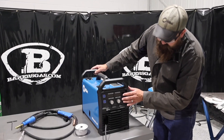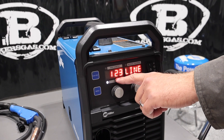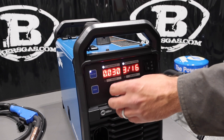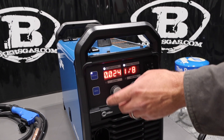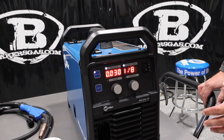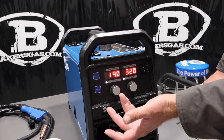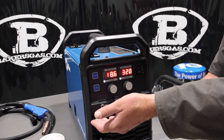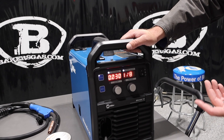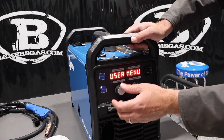Let's turn this thing on. You'll notice a very bright red display on the 142 — it's going to give you your voltage input. I just had it on auto set there. Auto set does .024 and .030 — there is no .035 setting for auto set. The machine will run .035, but you have to turn auto set off and go into manual mode to adjust it. Today we're going to run .030 wire and use auto set to give it a good run and see where the settings lie.